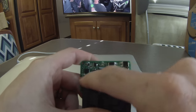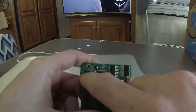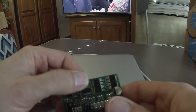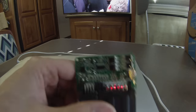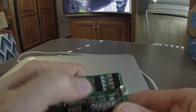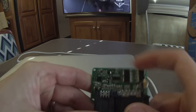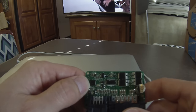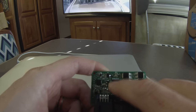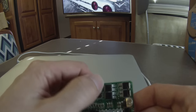We've got some resistors and a capacitor on here. There are two ICs — these have a rubber coating over them for protection since this sits under the front of the driver's seat. My guess is the smaller one on the left is the LIN controller, handling communications back to the BCM, and the other one is the actual board-level controller. The four bigger chips on the side are FET power supplies.